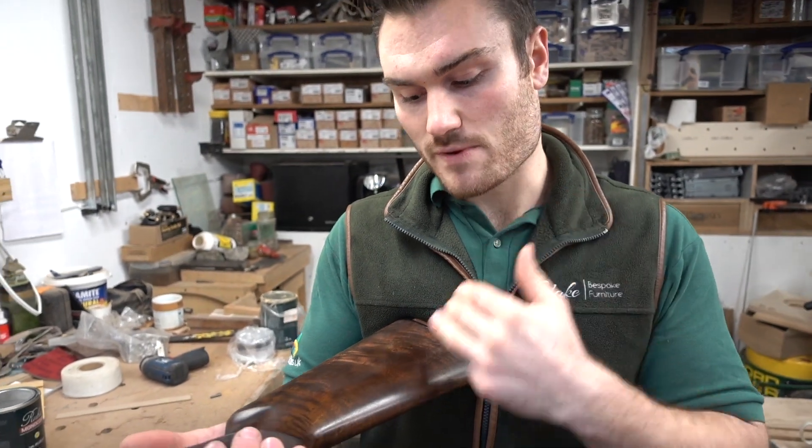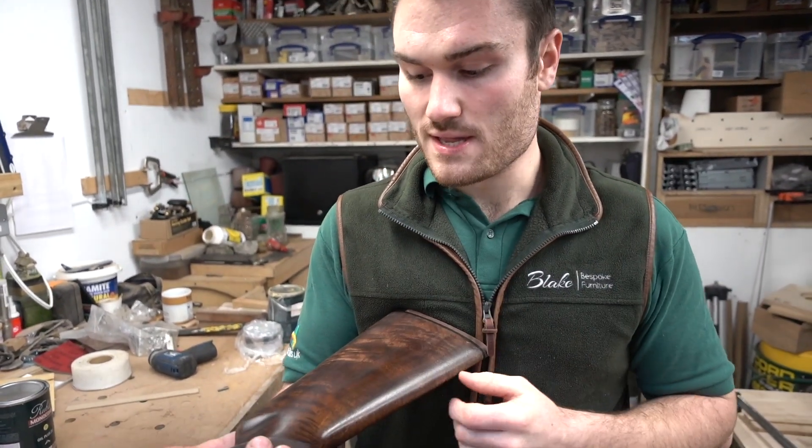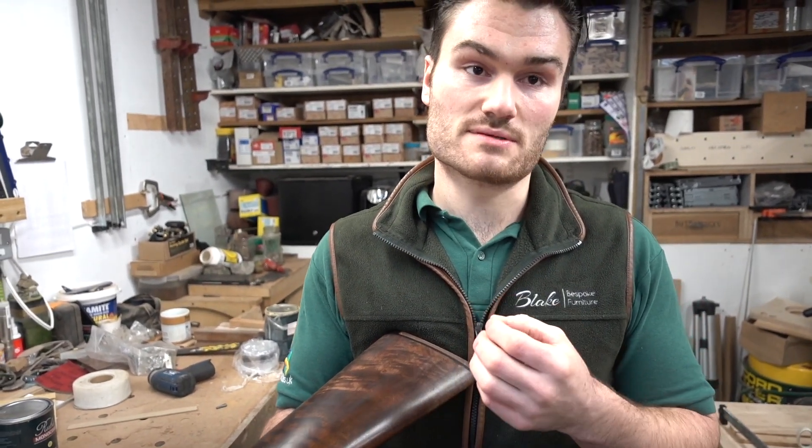You want to make sure there's no grease on the gun. The gun will pick up a lot of grease and oil from the human hand — you see it anywhere on surfaces used for a period of time. On the gun stock you probably wouldn't see it, and if you didn't remove all of that grease the finish wouldn't take to the stock, it would lift, and the finish can bubble and crack. With the oil it's really important to apply thin layers and build up — on gun boxes it's between six and eight coats, depending on how the finish is going.